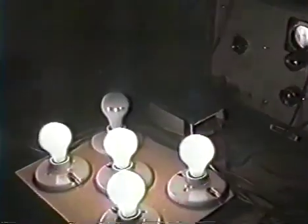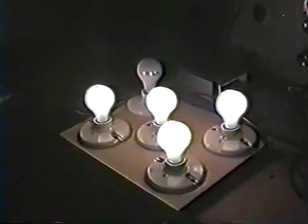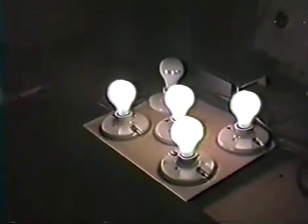Now in the lower left of your screen, again, 4 brilliantly lit, ordinary 100-watt lamps, household lamps. You can see here the 24-volt DC motor. You can see the transformer stepping down the voltage, the 2 12-volt lamps in series, so that we have effectively a 24-volt resistance, with 24 volts applied across them. And in front of that, then, we are rectifying this power to furnish DC power to the DC motor.